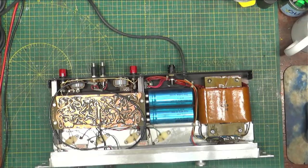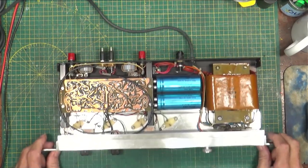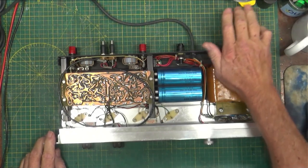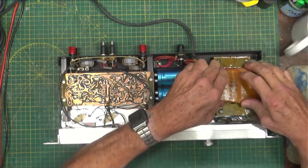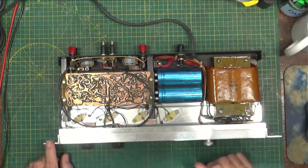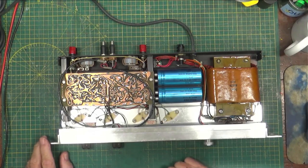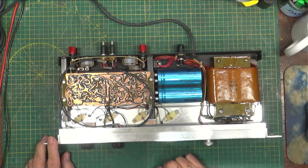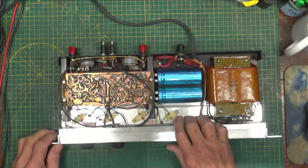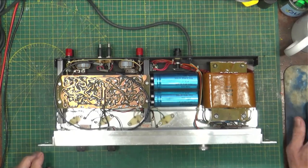We're off on the power supply over here so we don't have to worry about it. Let's take a look inside. These things are interesting — big old pancake-style transformer, a little bit loose on the metal going through it, which is probably why it hums. A couple of big 7,000 microfarad 40-volt Mallories — I doubt those are bad. And then there's a board with what looks like a bunch of capacitors on it. Let's take a look at the schematic.